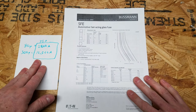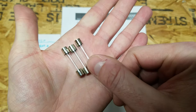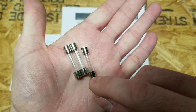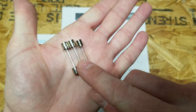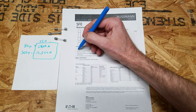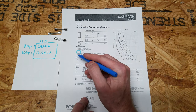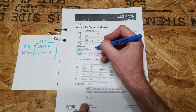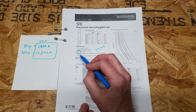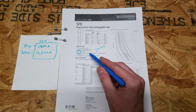Keeping those numbers in mind, let's look at some standard fuses commonly used. These are standard glass tube fuses — just a glass tube with a thin element — commonly used in automotive or low-amperage AC applications. The Bussman datasheet shows this fuse is rated for 32 volts, which would be fine for a 7S battery bank at 29.4 volts full charge. However, there is no interrupt current rating given for this fuse, so it is not an acceptable fuse for a lithium battery bank.